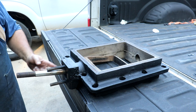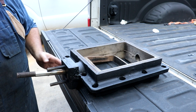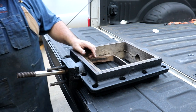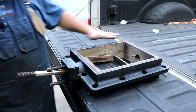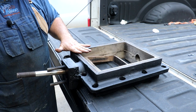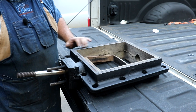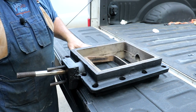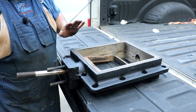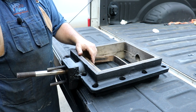What had happened is that this had been broken about 25 years ago, they had repaired it by welding it back together. That weld broke, so we came back in and re-brazed all this up to hold it in place, hopefully keeping it together until we can get a new steam chest cast and machined. We've got the original blueprints from the Vulcan Ironworks factory, dated 1917 — the same year our locomotive was built. We're going to have a pattern done, get a new part cast, machine everything out, and eventually replace this with a new casting.